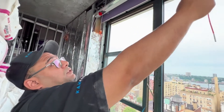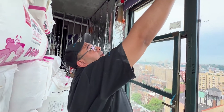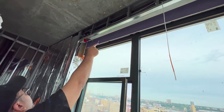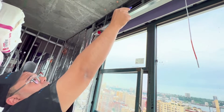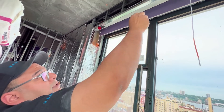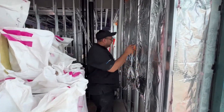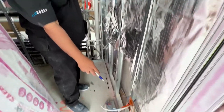This is the same scenario as your living room for the rear speakers. If you do the ceiling drop, I'll have the ceiling cavity to work with. Again, you have that same sprinkler pipe issue going here, so you'd probably need to do the same style shallow-speaker setup. You might be able to do a smaller speaker below since there is some gap, but it would be similar to that setup. So one speaker here, one speaker there. I have your TV right here, and I have a low-voltage subwoofer connection right here.